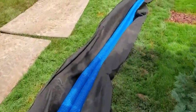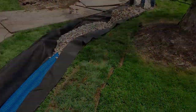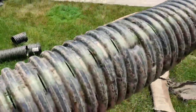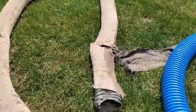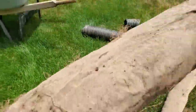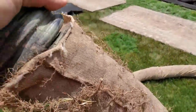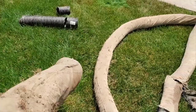We create a big reservoir here because we have so much sheet water coming off the playground and the swimming pool. This system used ADS pipe and we found a bunch of it collapsed — it's just flimsy and it's garbage. You don't want to buy a pipe with a sleeve or sock on it; it's a failed experiment. Your aggregate needs to be properly contained.